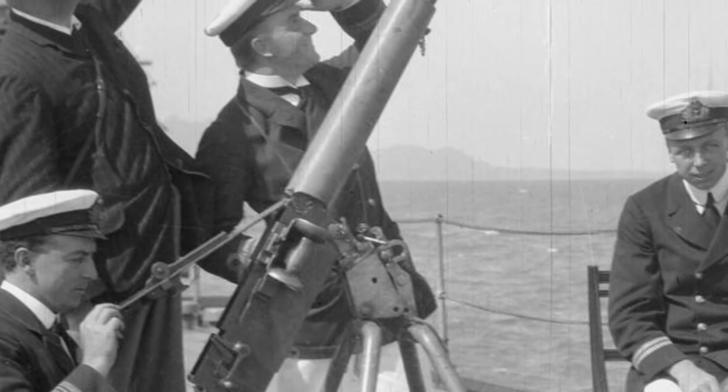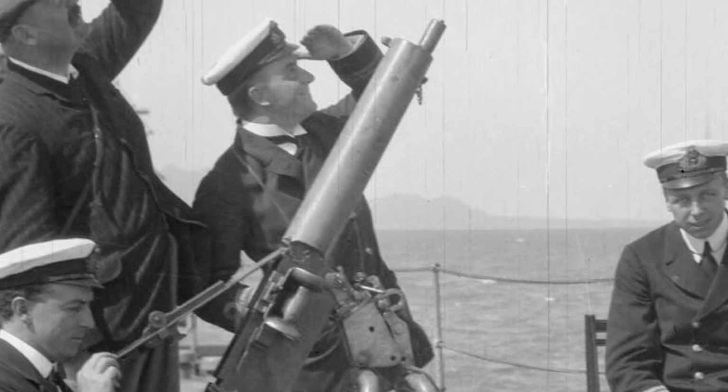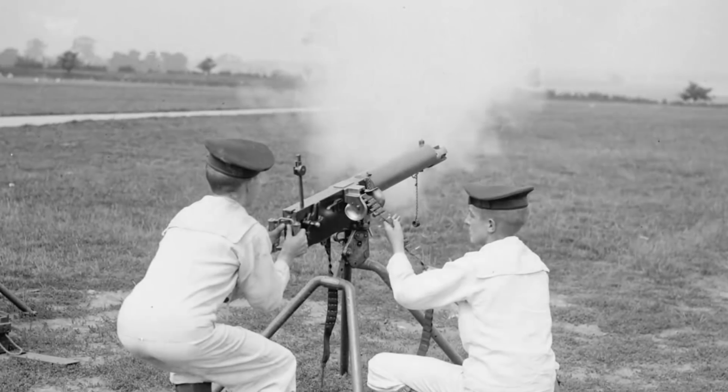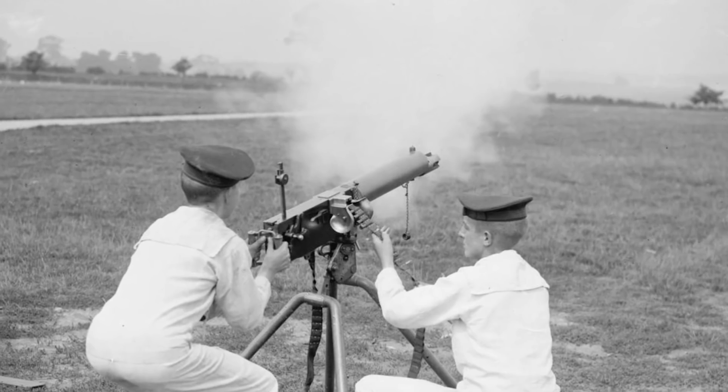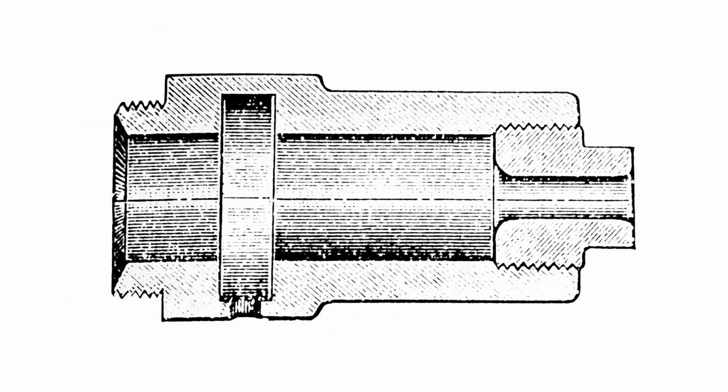The guns had been produced for the heavier, recoiling black powder cartridge and would not cycle 303 without aid. Luckily, Maxim had already done some research on forcing recoil thanks to making blank fire adapters for his guns, so a set of muzzle boosters would be worked up, the Mark I and Mark II, with the version depending on what sort of barrel weight you had to shove around.